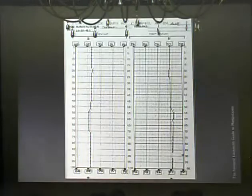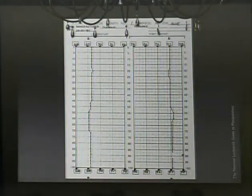It's pretty simple. To take advantage of this, you create a map of the radius of the wheel pack. If you're a mathematical type, it's a map of the radius of the wheel pack as a function of angular position. What it's doing is, you turn the dial three times to get all the wheels moving together, and then at every particular position, you map the radius of the wheel pack, that is, how far away the contact points are. These contact points get further apart as the wheel pack radius at that position goes up and closer together as the radius goes down. That means where the contact points get further away, there probably isn't a gate in the wheel, and where the contact points get closer together, there may be a gate in the wheels. Exactly how this works is a matter of practice.